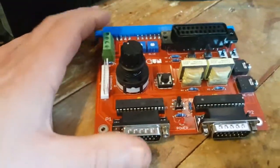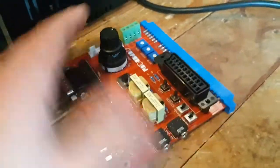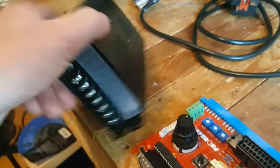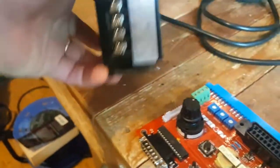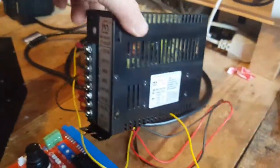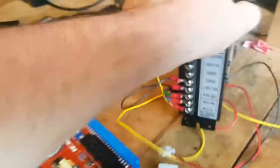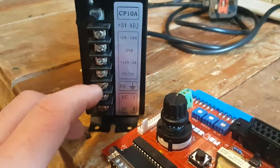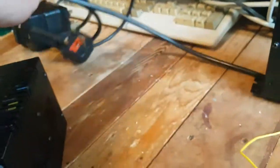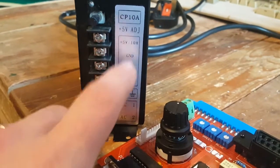What we're going to do first is find a nice piece of wood board to fix this on. To power this, we're going to use the switching power supply. This is actually a cheap Chinese one - it'll do just fine for the purpose of testing. If you were to use one of these in an arcade, you'd probably get a better quality one. These will do just fine. What they do is you connect your power supply coming from one of these into here, and this provides minus 5, plus 5, your 12 volt and ground. So we're going to connect all this here.